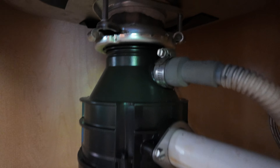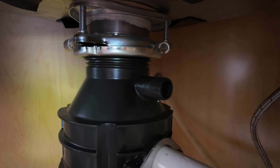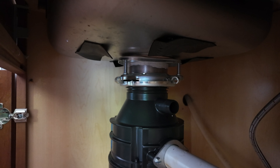And we're going to disconnect the discharge hose. Have a bucket ready for any water in the line. Stick your finger in there, there's a dead end. So if you were to run your dishwasher, it would have nowhere for the water to go. It's really embarrassing, and it probably could be quite a disaster.